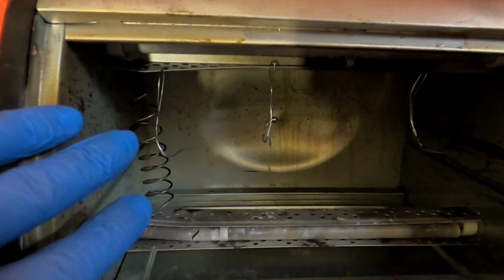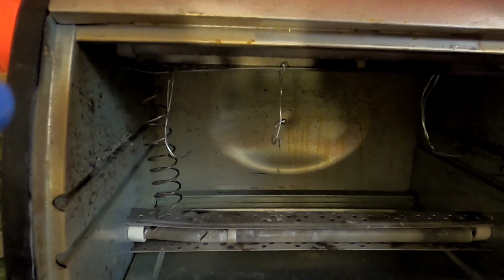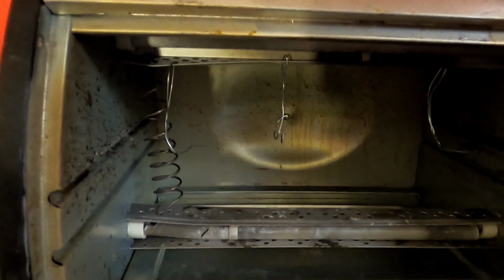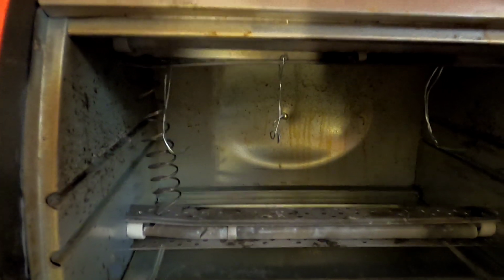So that's very important, because if you don't practice, what's going to happen is when the parts are hot, you're not going to be able to move them around, or maybe you're just gonna mess it up, and then you have to start over again by stripping the powder and then starting over, and it's a huge pain.